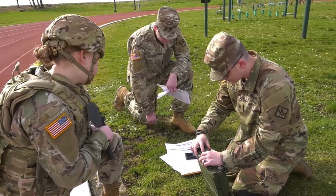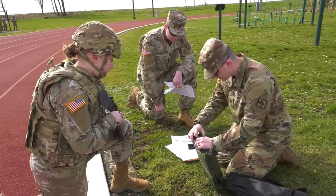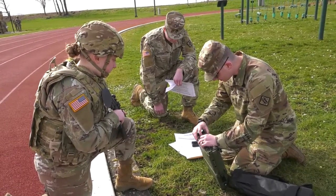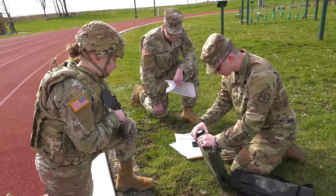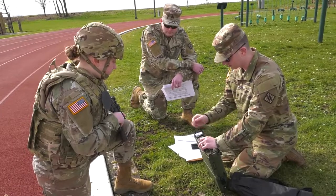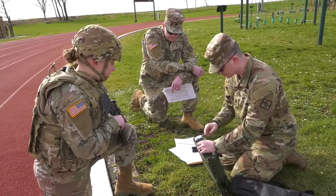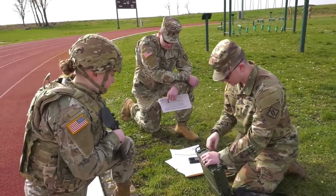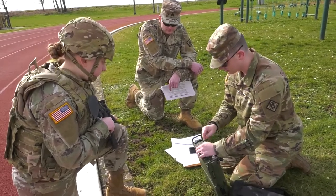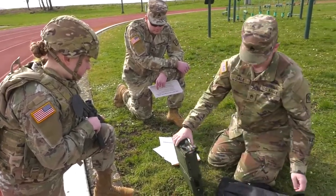The main will be FMCR. Hit enter — that's the last thing to change, then clear out. When the radio powers on it goes to channel 00, but there's a preset channel selector you can toggle up and down to go through your 99 nets. Once you hit over to 1, you'll see it doesn't say the default net name because we went through and changed the FM command. That's setting the preset channel.